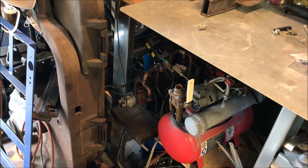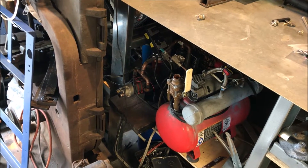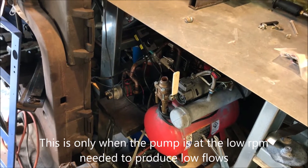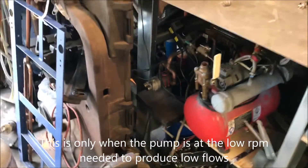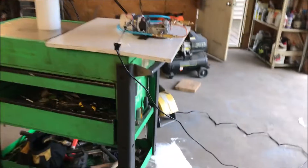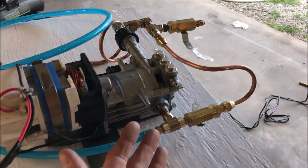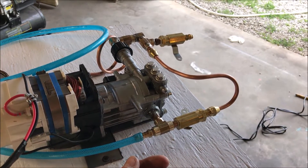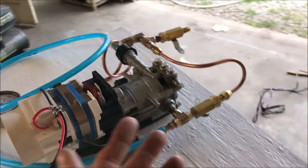That frequency is very observable in the flame and it does things that I would consider to be unstable. It's just not as stable of a combustion and I don't think it's as hot as I can get. This was a pretty huge success for me on this test. I built one of these years ago for an oil pump and it didn't work — I wasn't able to get the flow rates right, and I think all it was is my valves were just too big. I used large valves like these here and they don't give you very good fine-tuning when you're going for super low flow rates.